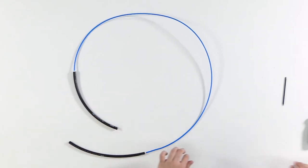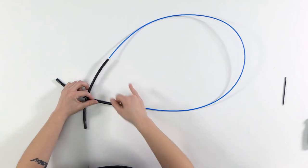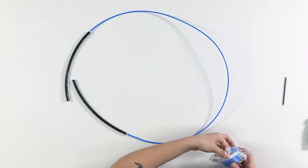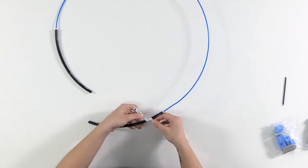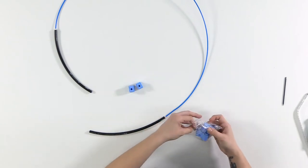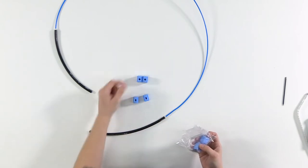I've got my 12-count round feed cable here. I've opened the sheath — from here to here is 41 inches for an inline application. Taking my cable measure tape and wrapping it around, I get a diameter of about 0.30 inches. Looking in my grommet kit, I've got two round grommets and four flat drop grommets. Because my feed is 0.3 inches, I've already chosen the round grommets with that cable range — I'll use the flat drops later.